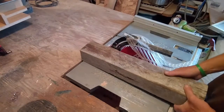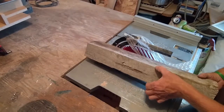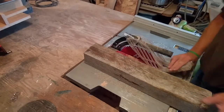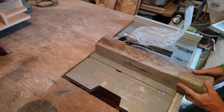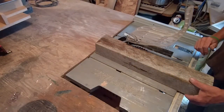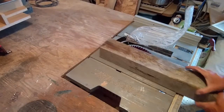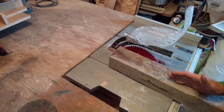Now this is the stock that I'm going to be milling and I need to have planks that are approximately 3 inches wide by about an inch thick. Now as you can see, if my safety guard is in place and my riving knife also, the blade at its maximum height will actually cut through this piece — it's about 3 and a half inches thick. But to take one pass, that blade is chewing out a lot of material.